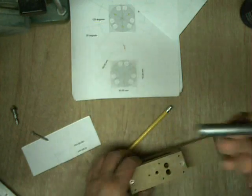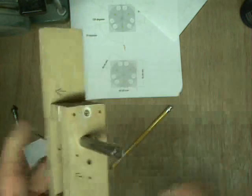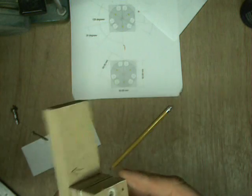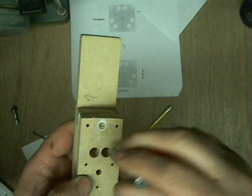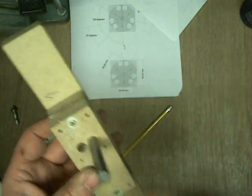You'll also require for this jig a little pin - I say a little pin, that's a 10mm piece of bar. Again, an off-cut from a piece I bought from the local DIY store - you know the one with the big orange logo in the UK. So when you drill one hole, move it round, put that in, shove it all the way through, and you can drill your second hole.